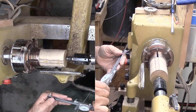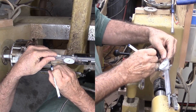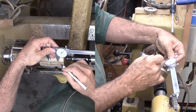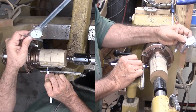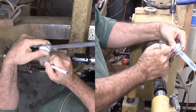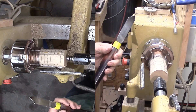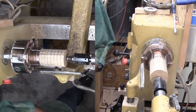Now for the paperwork and the math part. I've measured the length and the diameter. Since I want them in the same ratio as the golden mean, I check to see which is the limit — it is the length. So to maintain the golden mean, I need to reduce the diameter a smidgen. I'll do that later. With my phone calculator, I calculate the numbers that multiply by the length of my cylinder: one for the diameter at the middle, one quarter to each end, one half to each end, and three quarters to each end. I am laying out all the lines on the cylinder and noting the diameters on a piece of paper.